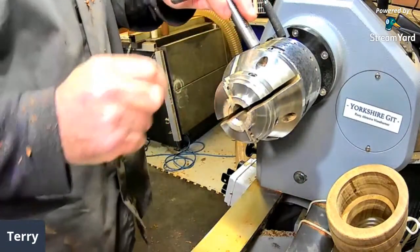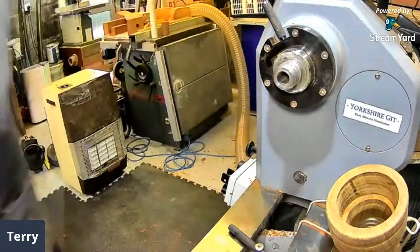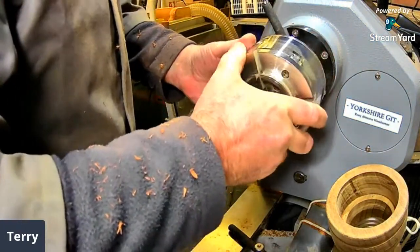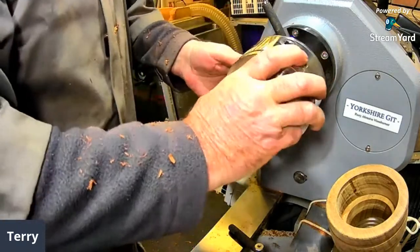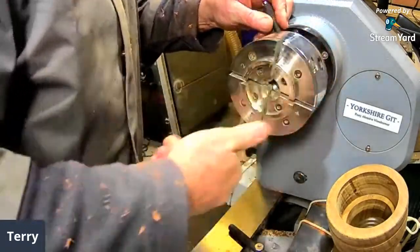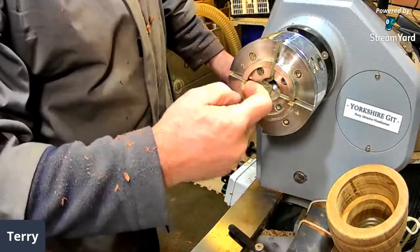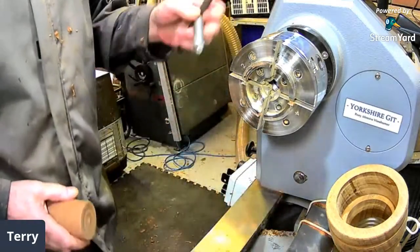Yeah. So I'm taking off the old Super Precision chuck with the O'Donnell jaws on, replacing it. Gerard the French Turner's asking, would you use the bent Hope hollow tip on the piece like this, or is it not worth it? It's not worth it really, because you can get into where you need to be, but it depends on how deep you want to go with the hollowing. So I'm putting on the SK114 chuck, Axminster, with the C-jaws. C-jaws have a dovetail on the outside for gripping internal work, and a lip on the inside for gripping tenons, external work. And we're going to put a piece of timber in the chuck.